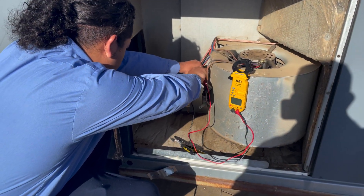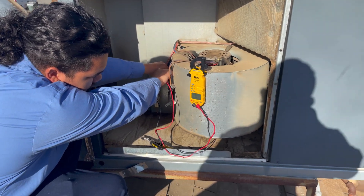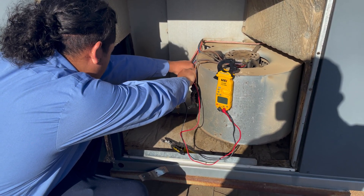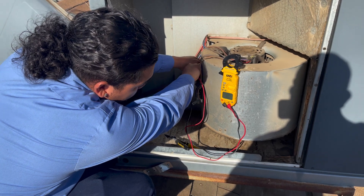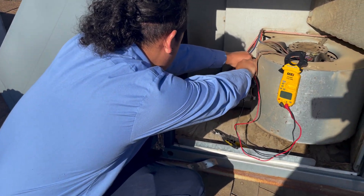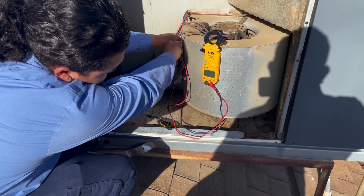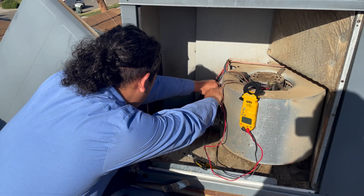We've already cleaned out. I went ahead and showed them a little preventive maintenance on these Goodmans — they get a dirty flame sensor that'll give an error code for failure to ignite. The customer had shut the breaker off, so it kind of reset everything. We cleaned the flame sensor, checked the EVAP — EVAP coil's clean. Now having him check the capacitor to the blower. It's a 10 microfarad.